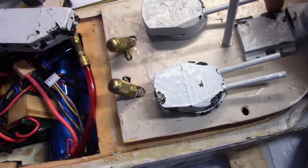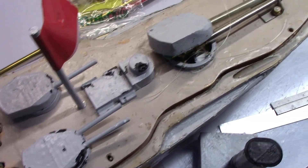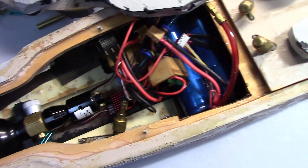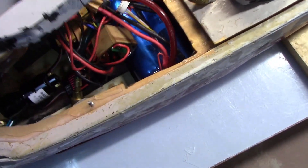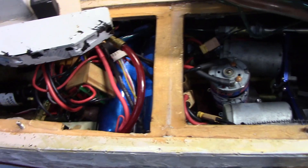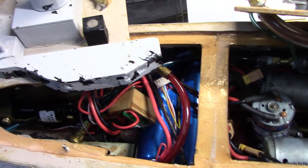For this boat, it's a really tight build — it's a bit more representative of how challenging the internal layout can be on a smaller boat. If it's a smaller boat that's heavily armed for its size, it can be more constraining to fit everything in. Other factors on this one are the cross-member locations. I put one right behind the guns and another one midships — which really isn't ideal, but it allows the two deck pieces. I also had to consider where the magazines were, because I didn't want the magazines running into the cross-member.